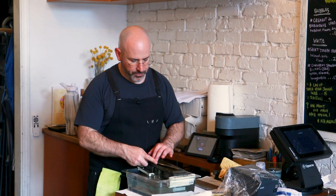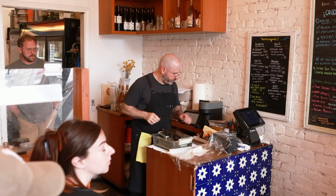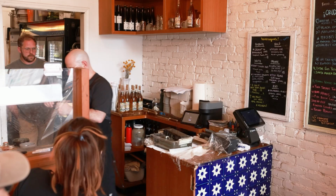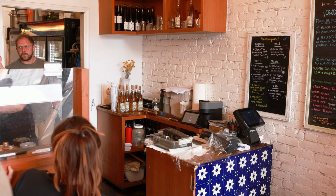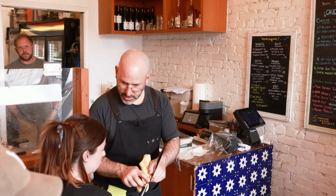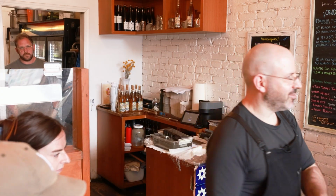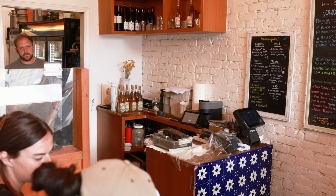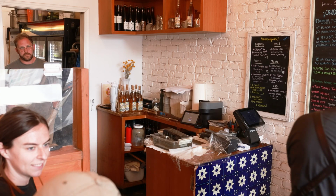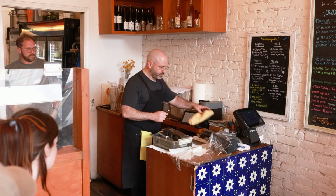Make sense? Cool. So otherwise, same deal. I'm going to just sharpen the heel really quick so you can see the difference on one side of the knife, what the finishing side looks like relative to the medium side. So if we look now, you can see shiny, shiny, less shiny, right? You can see the difference there. Beautiful. So you can see a much shinier part there, much finer scratch pattern, less shiny here, less fine scratch pattern. I know we've gone over this countless times.